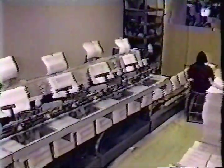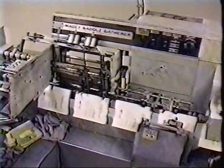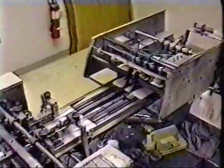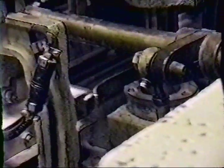One other operation that is often used is the Macy Collating Stitcher. This machine will collate folded signatures. Signatures are groups of pages folded into booklets. The booklets are collated together, stitched, and trimmed on three sides. The booklets coming out the end of the machine are the final product.